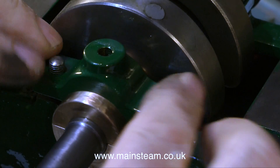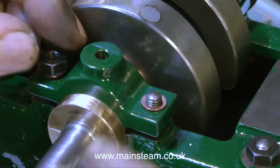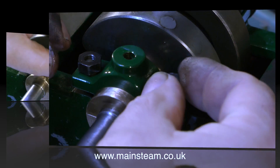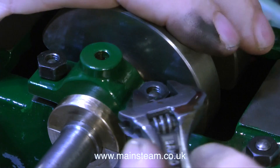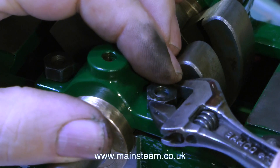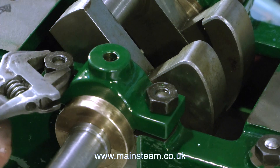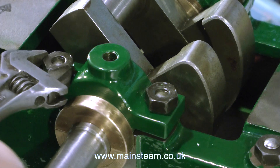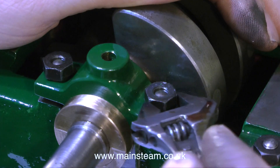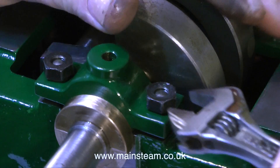While I've been talking about adjustable spanners, I'm fitting the second bearing top cap. You will notice that some of the nuts are a little bit beaten up - this is because they are not new, and they certainly haven't been beaten up by my adjustable spanner, but more like the ham-fisted attempts from some previous fitter who's worked on the engine. Whichever type of spanner you decide to use, make sure it fits the nut and don't put too much pressure on. The cast iron top cap at the other side was actually broken by some previous fitter over-tightening the nuts.